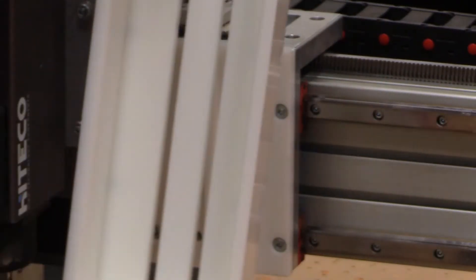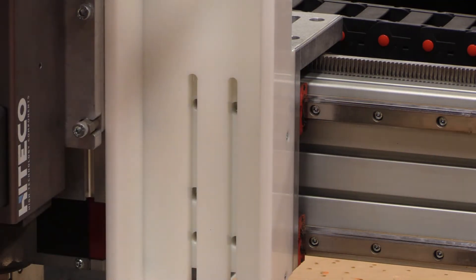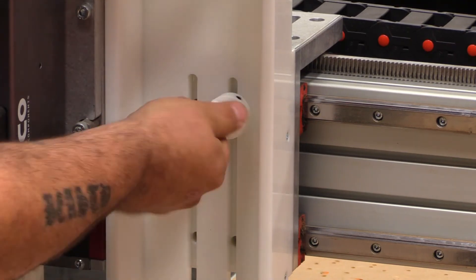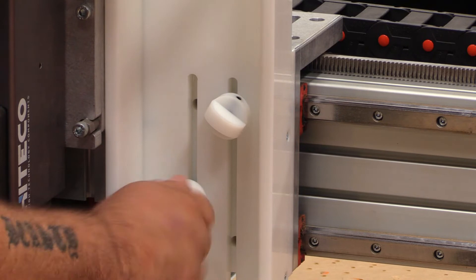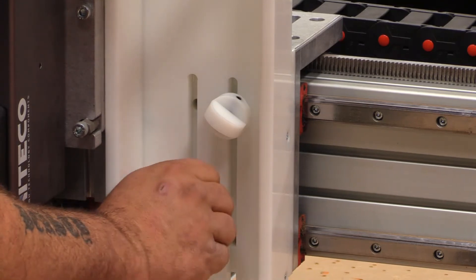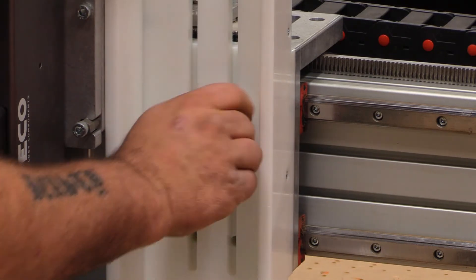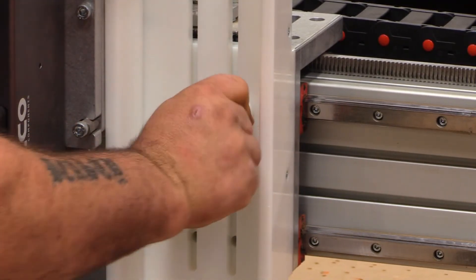Then your tower comes up next — that sits right over here. There's a track right here and the tower goes right over the top of that. Then you take your adjustment knobs — I call them adjustment knobs because this is how you adjust the height on the machine — and tighten those in. I put one in the top corner and one down in the bottom corner. Typically when I'm running this, I only leave the bottom one just snug enough that it's holding tension and I can still freely move the tower up and down. I lift it up and snug it just to where I can still move it but it won't fall. The top one is the one I use to fully tighten down, so I don't have to loosen two knobs.